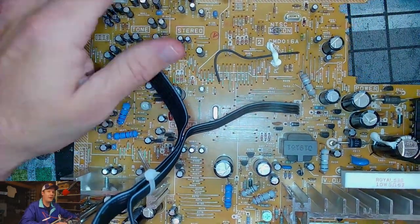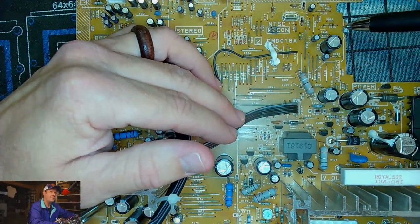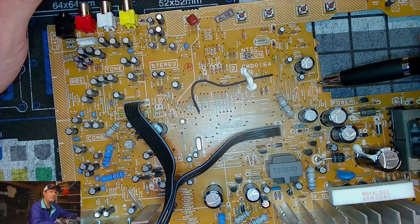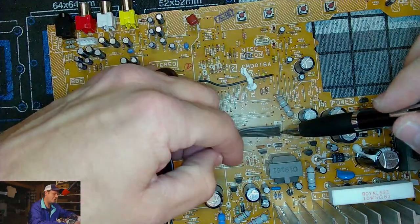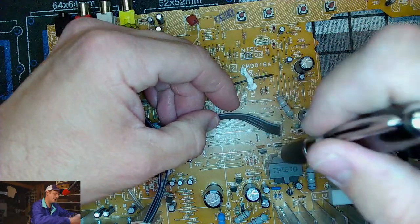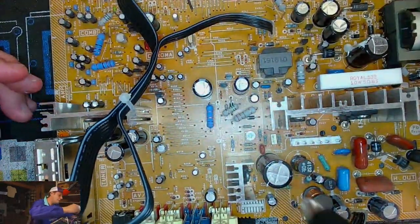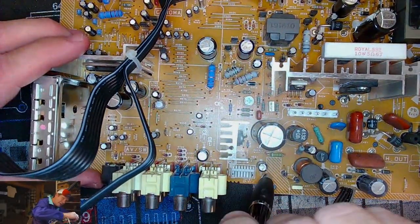The parts that we are worried about, we can follow along up here, up in the right hand corner where we have the missing section. That's where we're going to start, where it says 3 amps, 125 volts at the pin tip here. Following this line where this connection is, there's no capacitors over here, but we'll go down here where this transformer is, and the line continues down this way and follows all the way to this point and then off the board around this area.